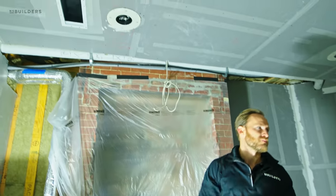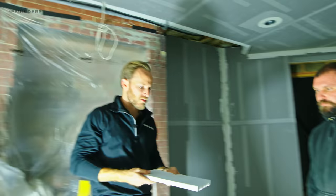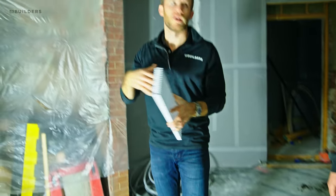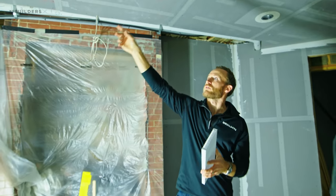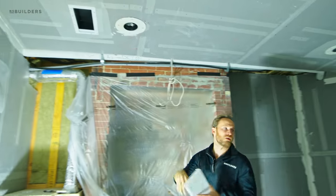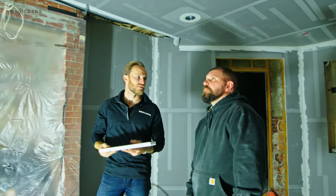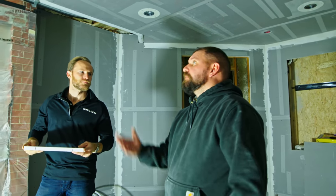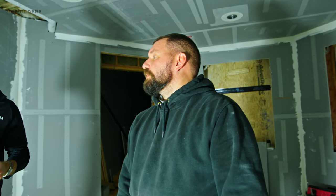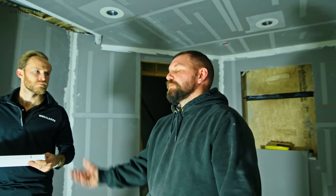These are Architectural Grills — powder coated aluminum bar grills. When we walked in, Colby and his team were setting that with a big straight edge in all directions to make sure it lines up with our trim ring on the light. As Tim explains, some of these lights and grills need to maintain distance and be straight with one another. Plasterers wouldn't necessarily know that, so we talk to them and make sure they set up a laser in the right spot and pull parallel to the right places.